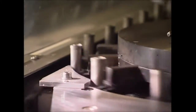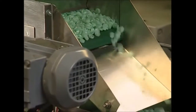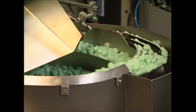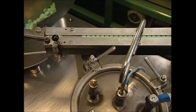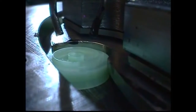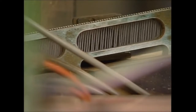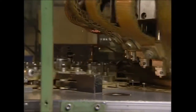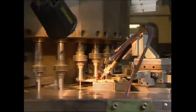Once fully combined, the gel is added into the lining in the battery cases. We've now got the two sides to the battery, but to make them work the electricity needs to get from one side to the other. If the electrons can't travel between the poles, the battery won't power your remote. To get around this, each base plate is loaded with a squirt of bitumen — normally used for road surfaces — which makes an excellent glue. Brass pins are then introduced, and this is the secret to how the electrons can get out.